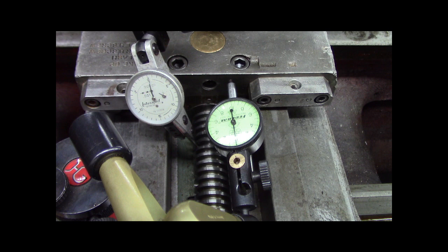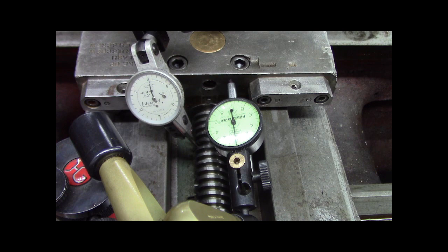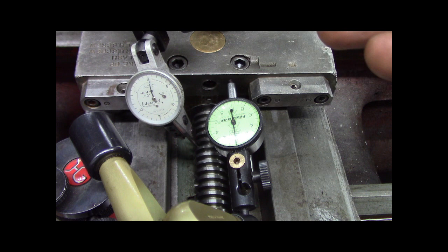I think when the nut, so maybe I've got to adjust the backlash mechanism. Maybe there's flex in that anti-backlash nut. I'll play with it, but the numbers I'm seeing here, folks, this is pretty good. But this is how you diagnose a problem. You keep moving your indicators around and applying your force until you figure out where the sponginess is in the system.